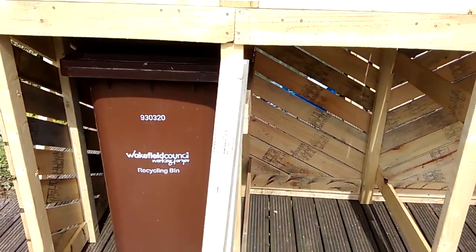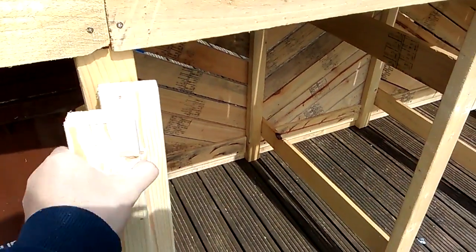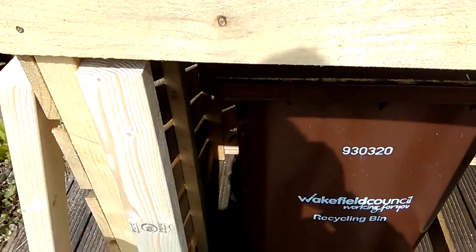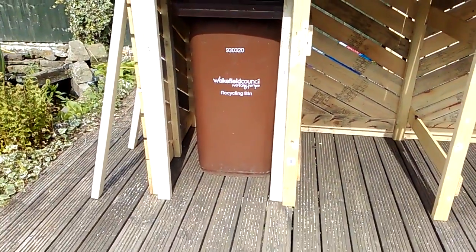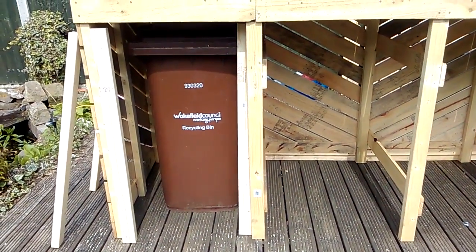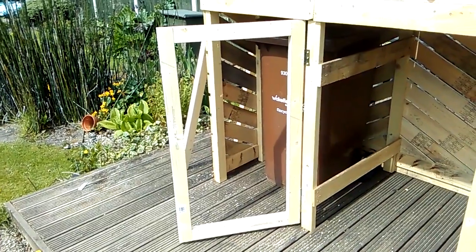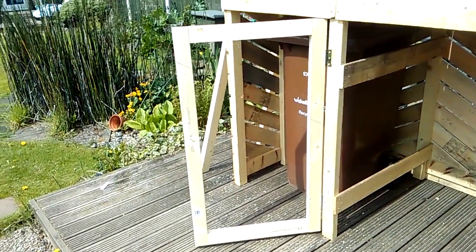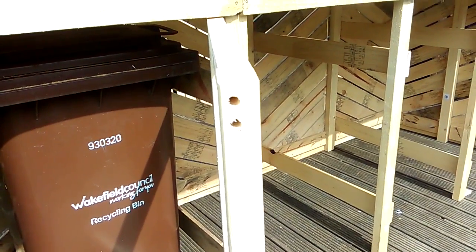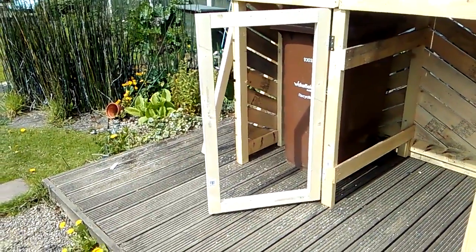And you can see we've got 2 struts there, which I've just cut, and they're going to sit in there and in there. You get the idea. And on the other one, lengthways, I'm going to cut 2 cross members, fasten that together, get it on, and I'll show you what I mean. And there you go fellas, you can see now I've got a framework knocked up, and I've just butt jointed it, no special. All I've done, I've just drilled and counterbored roughly halfway, put some big screws in, and we've now got a framework for a door.